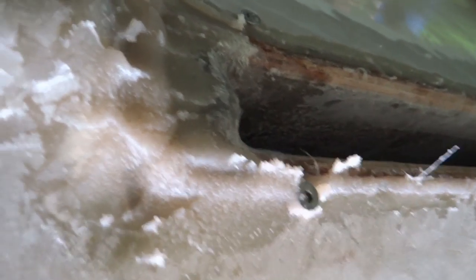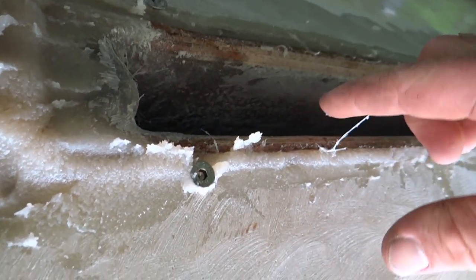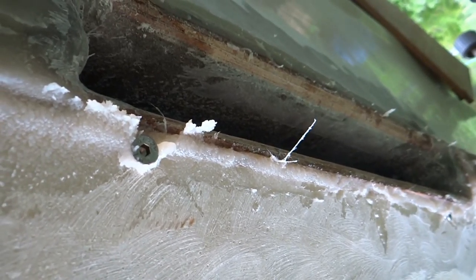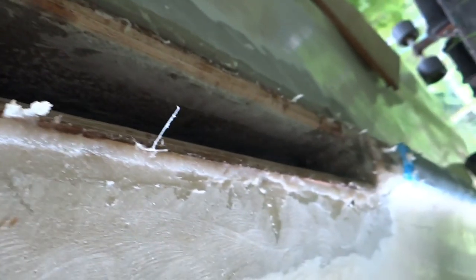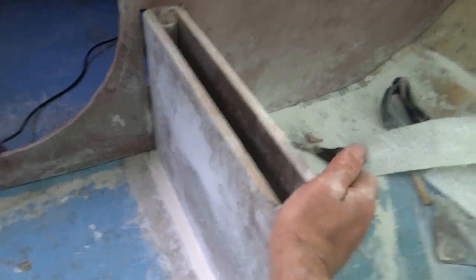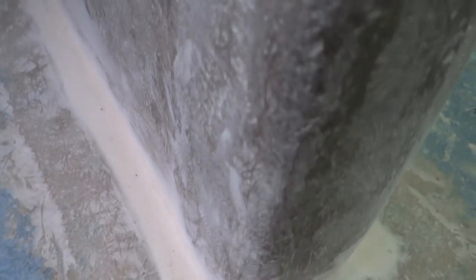I've got my box in — just set it up with some putty, like a polyester resin with quite a lot of microfibres, just to fill in the gaps. Once that's set, sand it back and put a couple of layers around there into the box. I've got these captured nuts in on the end — there was just enough space to squeeze them down the side. I didn't seal the top because there wasn't enough room, so I'm going to rely on the backfill — resin with glass beads — but seal this bottom part here properly first, then backfill. Completed that. Should work nicely. We've got a box in, rock solid, with foam in. It worked out pretty good. Now I'm just going to put a bit of glass over there to keep it all together.